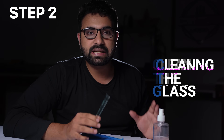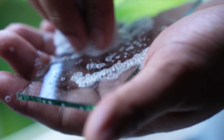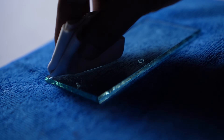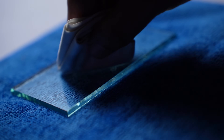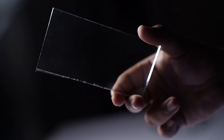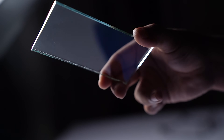To get a good engraving, your glass needs to be really clean. You can use soapy water and wash it under water — make sure you don't cut your hands. You can use alcohol to make sure it's really clean. After you are done, wipe it with a clean cloth. Also, make sure you don't touch the glass surface after cleaning, as this can leave fingerprints or smudges. You can use a cloth or pick it up by the sides.